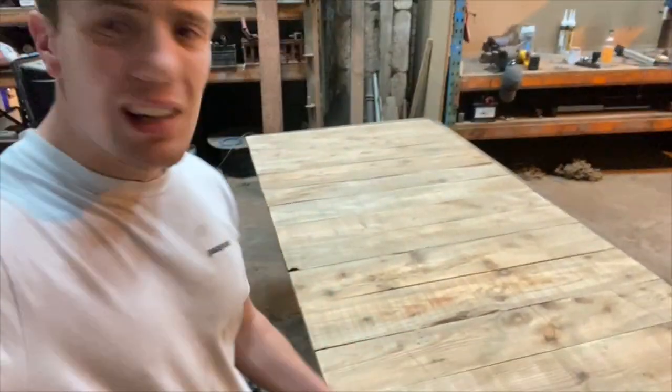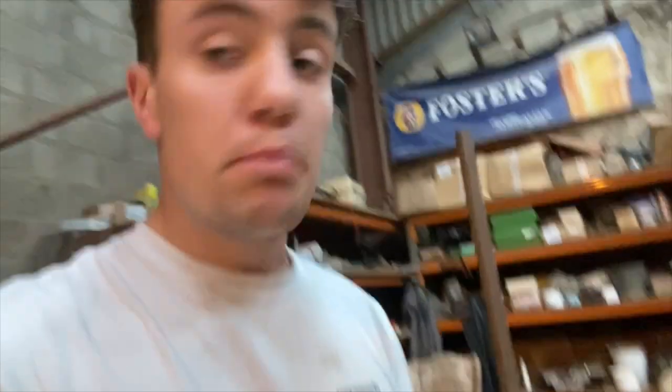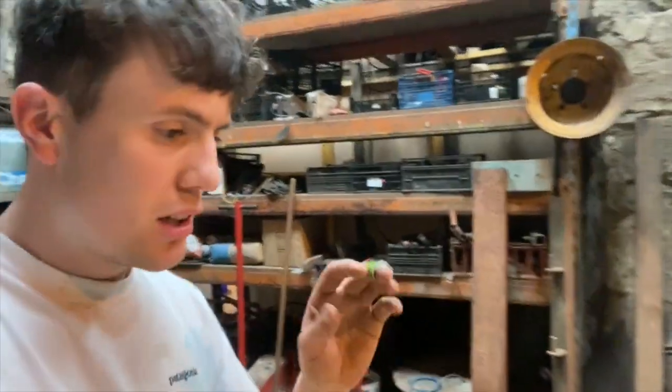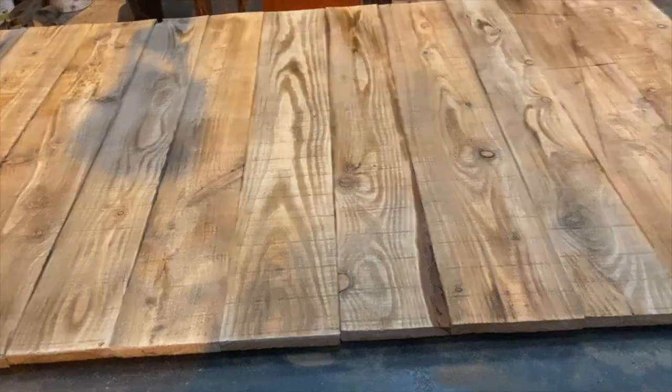That's it, nice and sanded. I don't really like the color it comes up when stained, oiled, or varnished, so I'm not doing that — I'm actually burning it with a propane torch. There's a big wide burner on the end and I sit at quite a distance from it and give it a light burn over the surface. It comes up fairly nice for the grain pattern and I prefer that to the stained look. So I'll do that to this now.